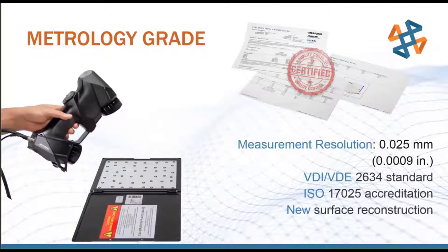Like I said, this scanner is metrology grade, so it comes with the metrology grade certifications that you see below there. These can be upkept on a yearly basis if required by your company. If it's not something that you require, then you can just let that paperwork lapse out of date and continue on with your user level calibrations, which is what we're seeing on the left there. It comes with a calibration plate, basically a calibration artifact that you'll perform several scanning maneuvers on yourself. And then the software will do software level compensations for any drift in the cameras or overexposure of the lasers or anything like that, and bring that back within the spec.